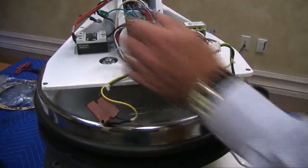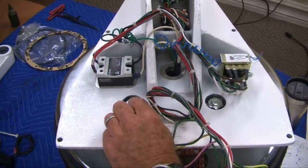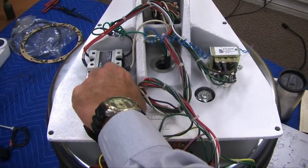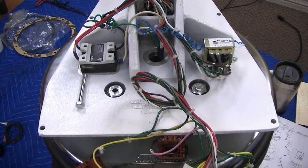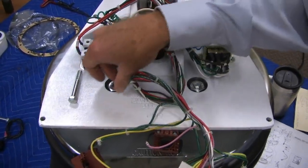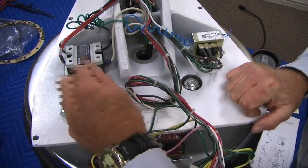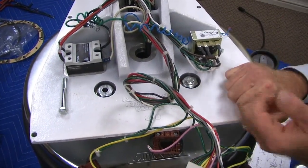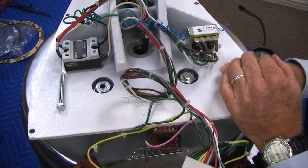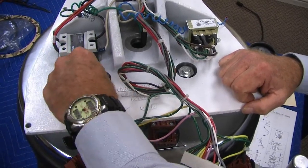As we have it today, you have four bolts up here, guys. You have an adjustment screw, that big half 13 bolt below, and then you have, I think this is a 5/8-16, called the locking screw. So if we're going to level the system, we pull these four locking bolts out, and you need a socket that fits in there or something you can grab this with. When you turn the front down, I'm talking about turning it by one eighth to start out. Some people want to crank that a little more, and what happens is they really set the thing off level. You start little and you just keep growing it until you get the right level. So if we see it thicker on this side, then we would probably take this down an eighth of a turn and try it.